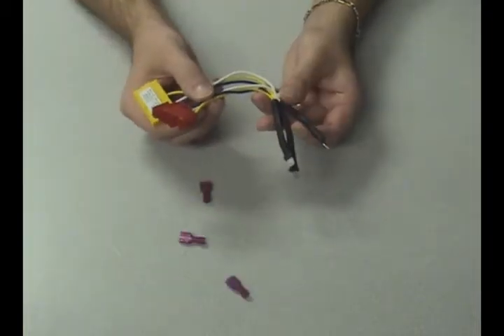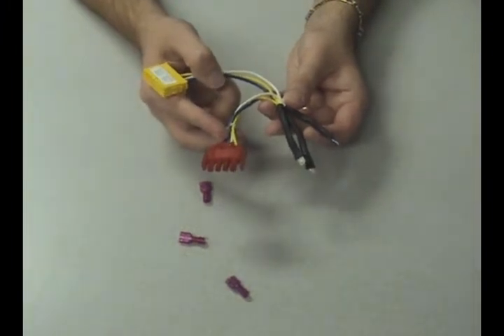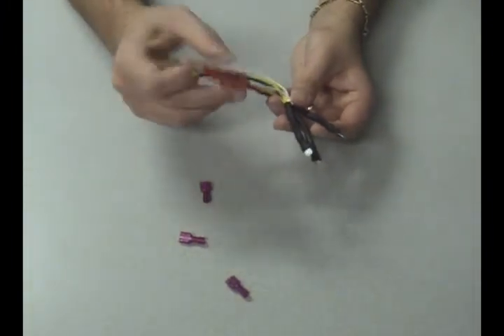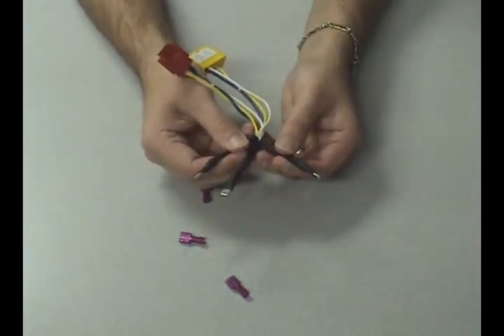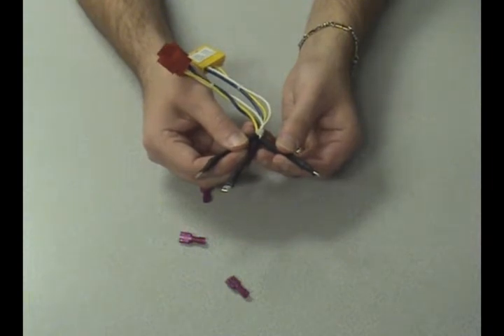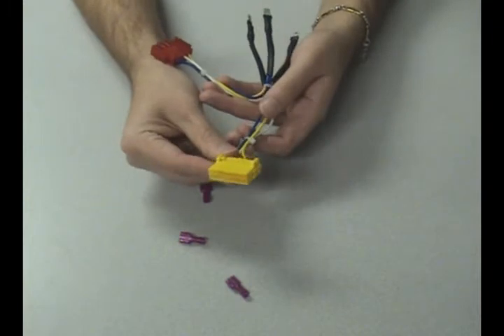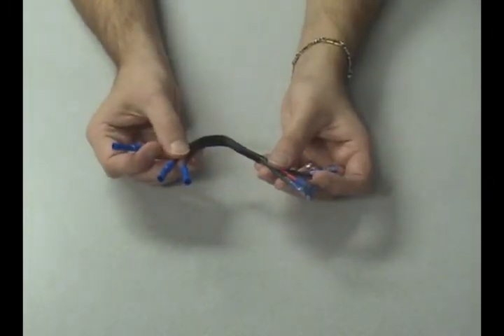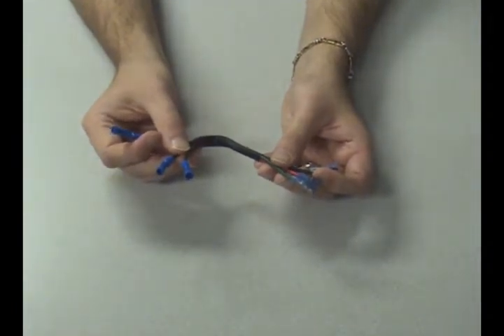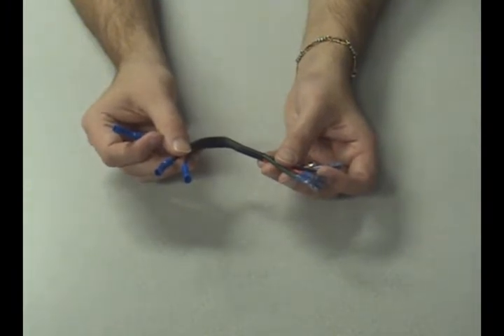The second adapter is called the red-yellow adapter. It has a red connector which can plug into the electronics module on the condenser fan motor, or you could use the three male quick disconnects to interface with the harness going to the motor in the circuit board area. The yellow connector is made to plug into the blue connector of your VZ7. The third adapter in your kit is called the power adapter, used to supply 240 volts to the motor's power connections when testing a removed motor.